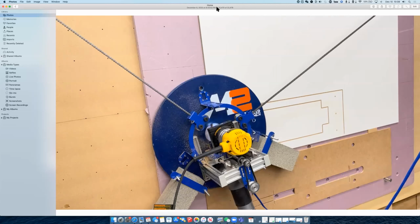This is actually a video, but I don't want to waste everyone's time getting to that point. The bottom right corner was supposed to be squared like the top right corner that you see in the white melamine. But it ended up with a 45 degree cutoff of that corner, and I could not figure out why until I realized, oh my god, when I wasn't looking, the brick bottomed out and hit the bench dog, and it guided the M2 sled up off that corner. So anyway, you can see I've been playing around with better ways to support my waste foam, et cetera. But that was where my idea came from.